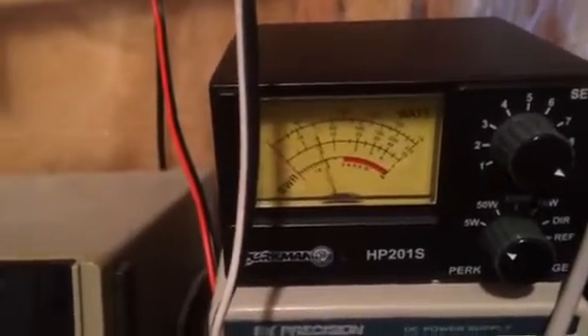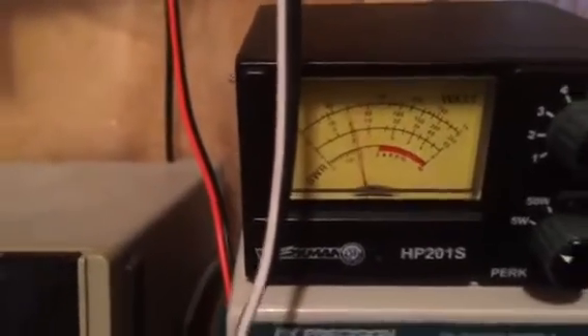This is the same setup I used in other videos. I have a 6 dB attenuator — remember, with LDMOS technology you only need one to one-and-a-half watts of drive. I like to monitor the input wattage: it's about 5 watts on the radio, so roughly 1 watt of drive after the attenuator. I'm using well-filtered switching power supplies, a 1500-watt dummy load, and my Bird 43 line section with a 2500-watt slug.